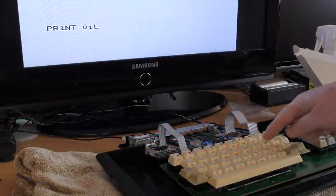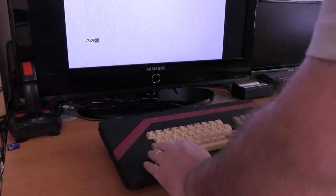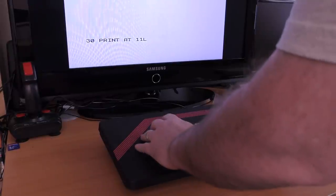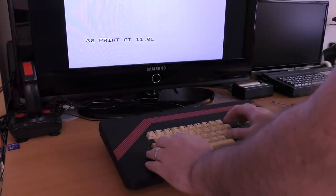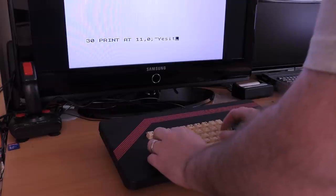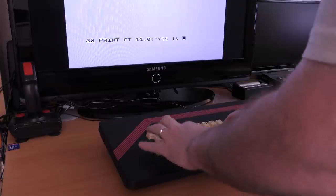It took quite a while, but then it was time to test it. Some keys didn't work and again I was a bit disappointed, but it was that pesky ribbon cable again — one of those joints had come loose. So a quick flashover with the soldering iron fixed it. Another test, and yes, a few keys had problems mainly down to lack of use, but after a good few typing sessions they were fine. And that was it — I had it back.